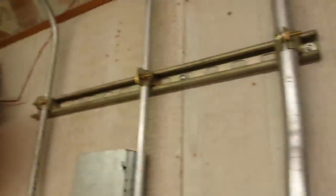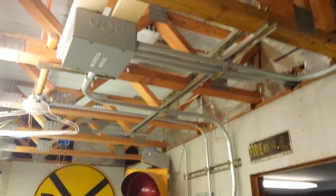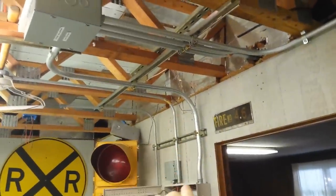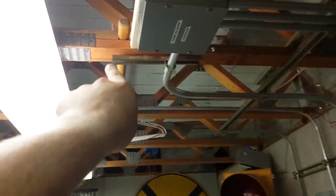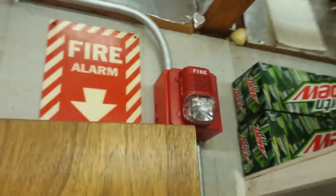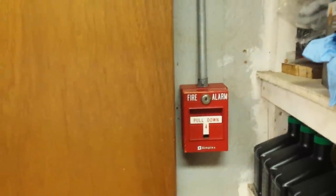You'll see that all my wiring pretty much goes through this conduit. This conduit here, as you'll see, I've mounted some strut, and up here there's also strut. It goes up to this smoke detector. If we step back, you'll get a look at how the conduit is now. There used to be a 4-inch square electrical box right there, and then from there the conduit basically ran over and down. We'll see now that it goes up. All the conduits are supported, and once it gets up on the ceiling it's supported. It then goes into an 8x8x4 pull box, and then there's three ¾-inch conduits, two of which go straight over to the closet. The third one comes over here to a Wheelock SBB-R deep fire alarm back box and a System Sensor P2415 15-candela horn strobe.